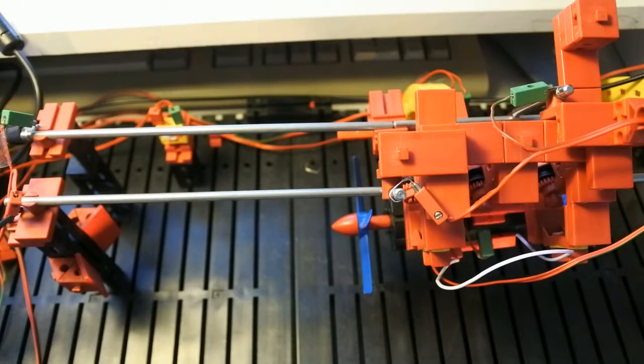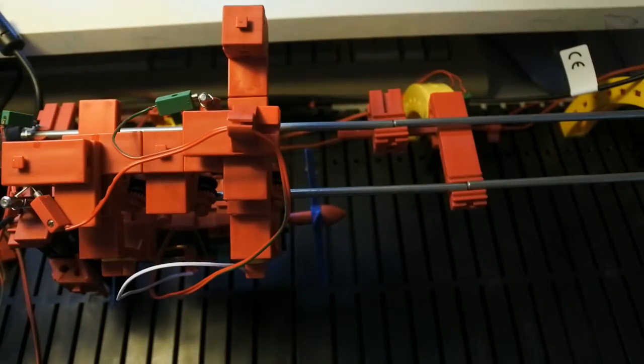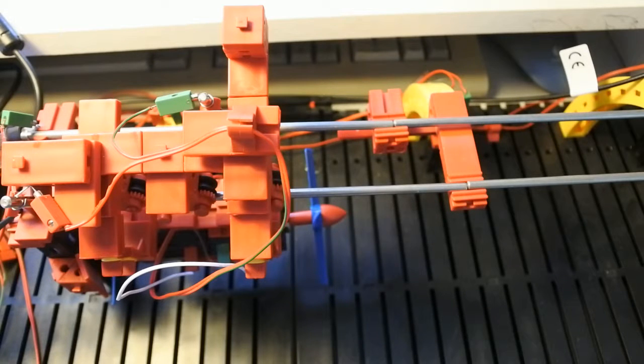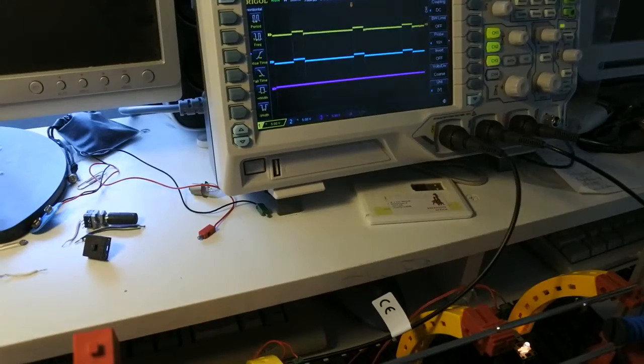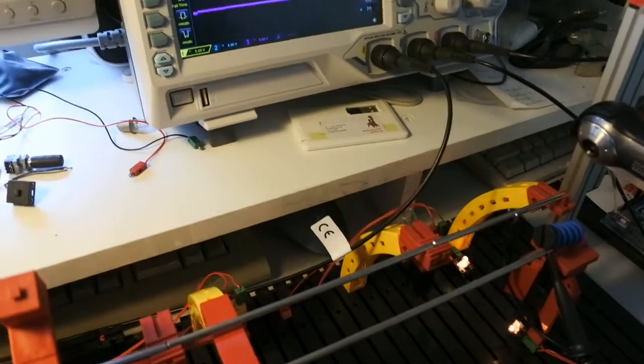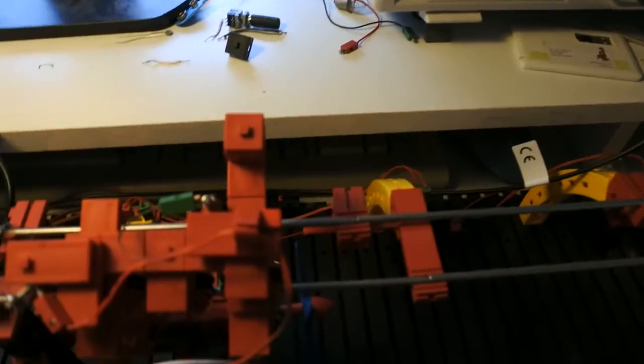Okay, let's put it there. And on the screen I can see that everything is detected normally. So that's even weirder. Alright. Well, not alright. Not alright at all. And again, the oscilloscope shows no pulse width modulation at all. No signal whatsoever, except for this, because the lights are blinking and that is shown. But not a regular signal I expect.